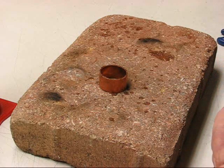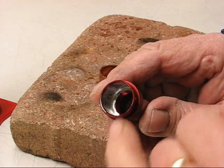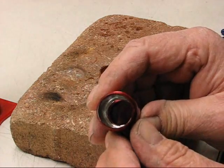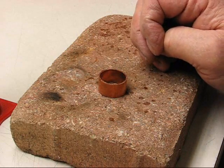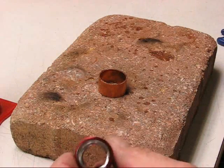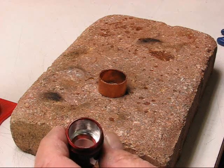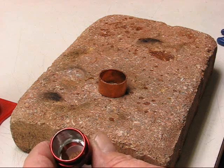In doing that, I have to make a fairly good-sized heatsink. I also have to open up the head. I've opened up the head with a Dremel, cut down inside so I can make a heatsink in there and also have the star fit in, because it's a 20-millimeter star. And I don't have anything that fits the inside of this head — plumbing fittings are either too small or too big.